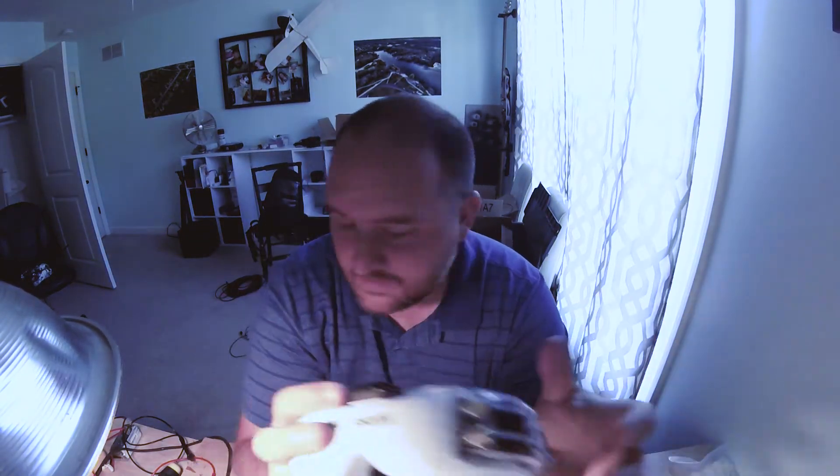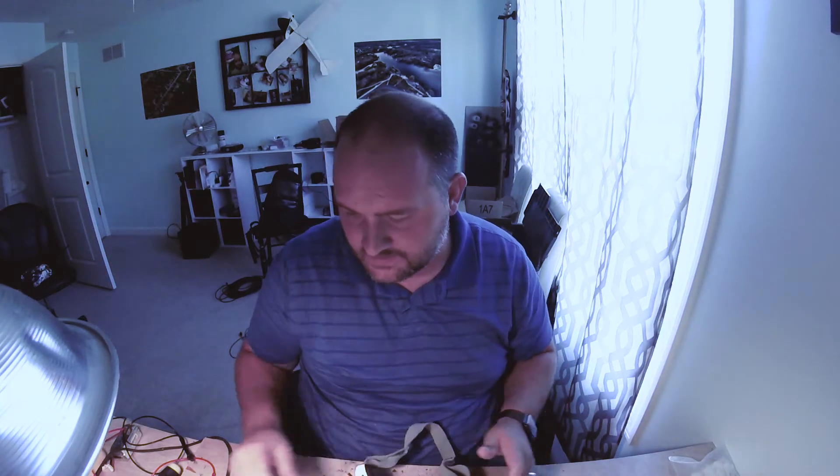That's it — it worked. I'm pretty proud of it. I'll give you a rundown of what I did. Essentially, I got into the goggles and looked at the back of the board where the main battery plugs in. In the back of the board there were three solder points for that connector. Using my multimeter, I figured out which was the positive — 7.7 volts — and which was the ground. From there, I took a little bit of servo wire, soldered it to those points, and ran that 7.7 volt feed into my step-down regulator.